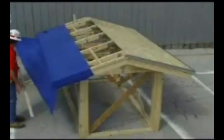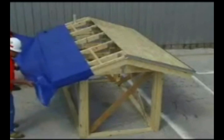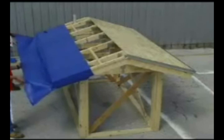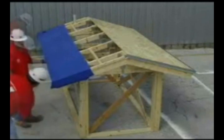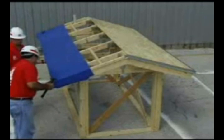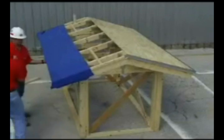Step 5. The 1-foot plastic overhang at the bottom edge of the roof slope, as shown previously, was left for a bottom edge furring strip. Wrap a furring strip at least 2 times with this plastic and nail that furring strip to the bottom edge of the roof as previously shown.